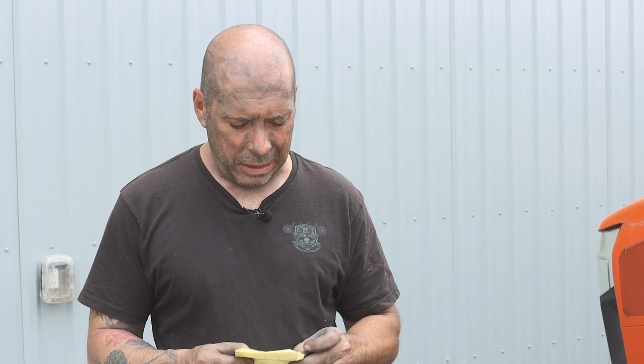Now color and clarity. That's the clarity the bar leaves after you've polished. Normally a primary cut doesn't leave a lot of clarity, and so that's why I'm considering this more of a medium cut over a heavy cut, because the clarity was very, very good. That makes your finishing process a little bit easier after you've done your cut.